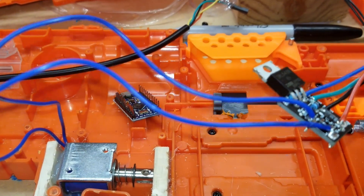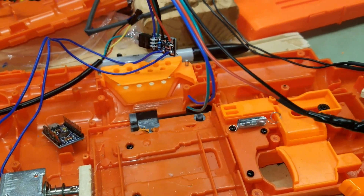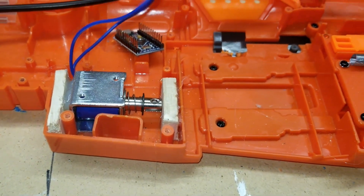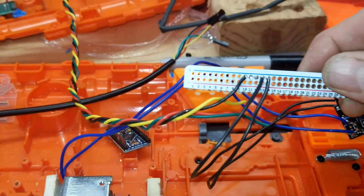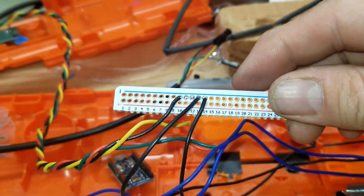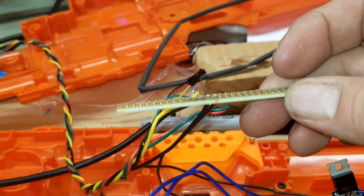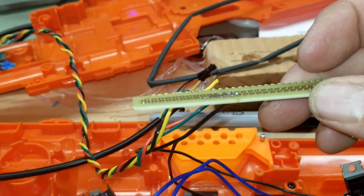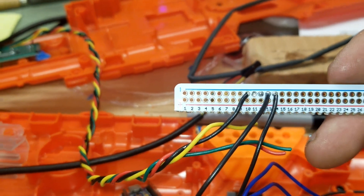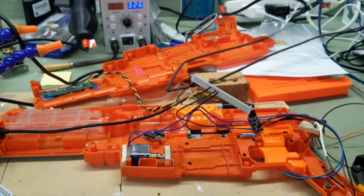I soldered into the MOSFET and started soldering in the power wires for the solenoid. I also started building a ground bar for the buttons — there are only two real grounds on the Arduino, so I'm making a little bus board. I'll bolt this down, and all the grounds for the buttons will come back to here. I think I have five buttons altogether plus the D-pads, which is another five, so there should be ten spots on here. That's about it for today — everything's coming along and hopefully I can finish this up this week.